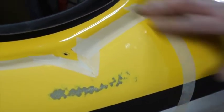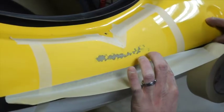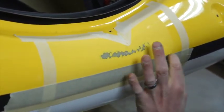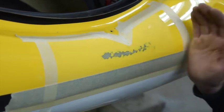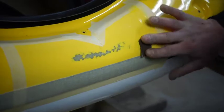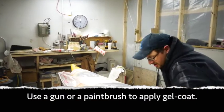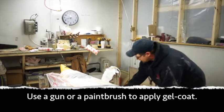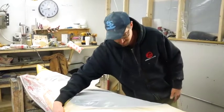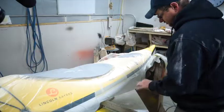It's pretty important to protect your seam because you don't want to spray yellow — you don't have to come back and spray black. What you want to do is get coverage over your boat. I like to go three or four feet either side. Definitely make sure you're covered on this side because I'm spraying in this direction while my overspray goes this way.